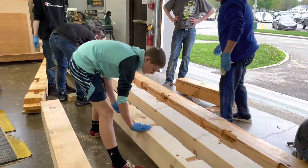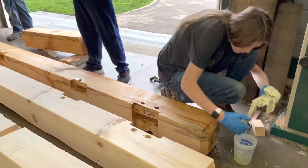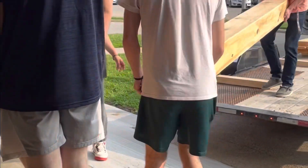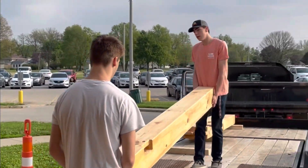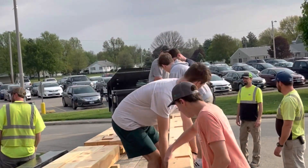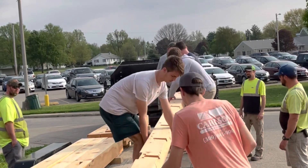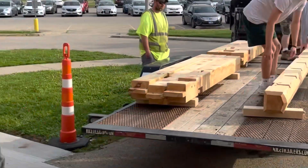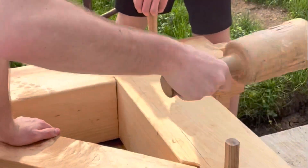Here we're using Heritage Natural Finish to seal the timbers. It's an exterior finish — we use wax on the end grain and oil everything else, giving a really pretty finish. Once you get those timbers sanded down to a nice consistent grit and bring the oil over the top, it really enriches the color and looked great with that green epoxy.